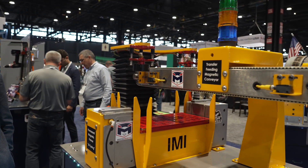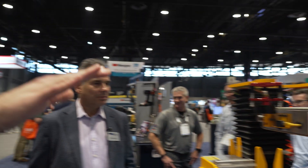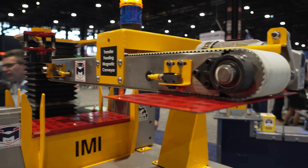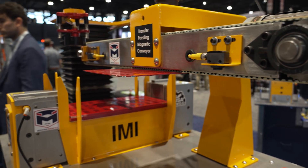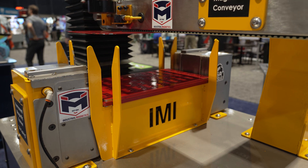And the types of companies that you would be targeting? We're targeting — we had a company stop by earlier that makes grills, barbecue grills, automotive stamping, ovens, refrigerators — anyone that's taking flat sheet and turning it into something else. The advantage of the magnets that you're seeing here too is that once the flat sheets are turned into contour sheets or perforated sheets, we can still lift those magnetically where you can't with a suction cup or some mechanical latch.